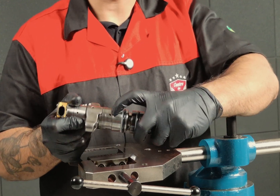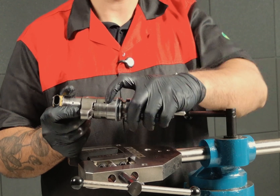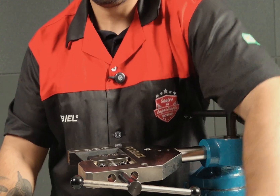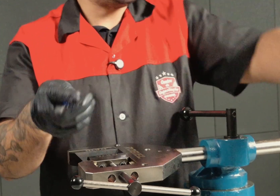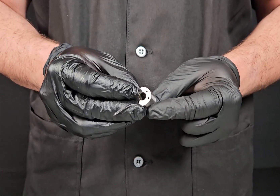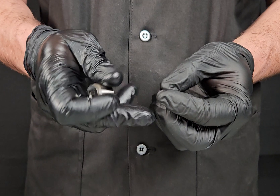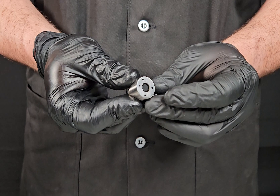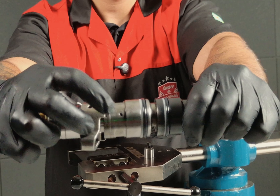Let's start with that small hole on the body. That hole is going to be represented by the control valve of the HEUI unit injector, and Robio has this valve brand new. Let's take it out of the package — this is called the control valve. That small valve is going to be representing the back leak on that specific hole. So you need to change this valve for a new one when you have back leak coming out from this hole on the body of the unit injector.